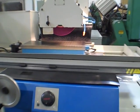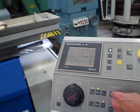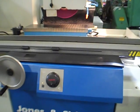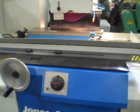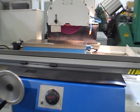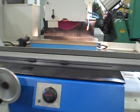While we're at it, I could probably slow this down a little bit like I did before on the table. Just slow this down. Here, you'll see the noticeable difference. See that? Nice easy grind. Same cycle, same program, everything's just moving a lot slower now. And while you're on it, I'm going to speed it up. I'm hitting the plus now. I'm just going to increment it 4 or 5 times. You'll see it pick up. There we go. That's directly related to cycle time, but of course it's all process, how fast we want to go.